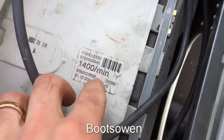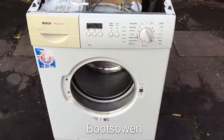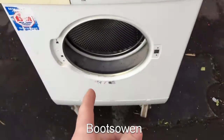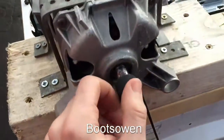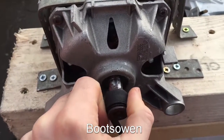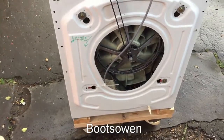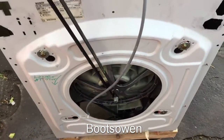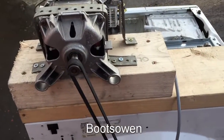It's rated at 1400 revs per minute. I think we can go faster with two motors — I just want to see what's gonna happen. What I was going to do is wire the bottom motor straight into the power and let it go as fast as it possibly can, measure the speed, and at that point it'll be dragging this motor. Then plug that one in and crank it up and see what happens. I'll try a few different things; maybe it'll just fail miserably, but I think it's worth a go now that I've gone to the bother of making this stupid contraption.